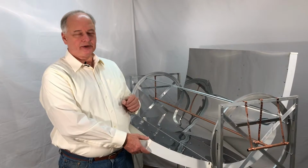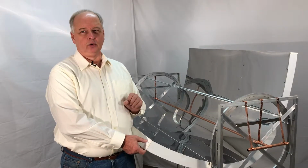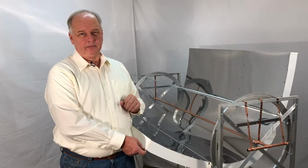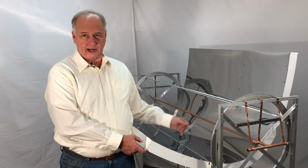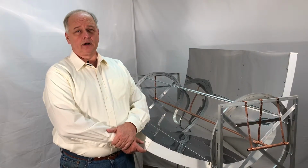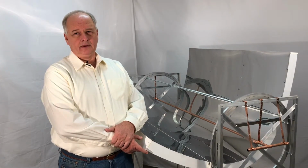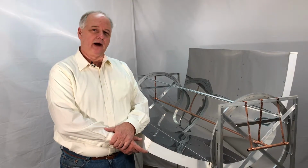The steam is under pressure, exits the steam drum, and travels to a condenser unit where it is cooled back to water. That water is pure and drinkable. This is repeated twice more since the brine's already heated up, and the seawater is now a brine and is pumped back to the ocean. Fresh water is desperately needed worldwide, and the RingTrough can provide it.